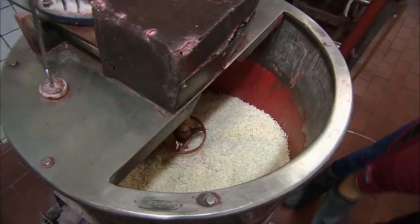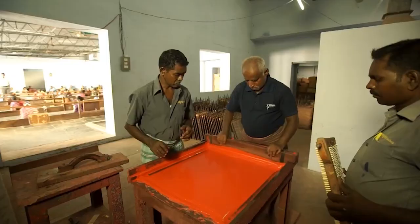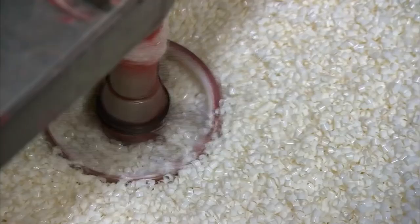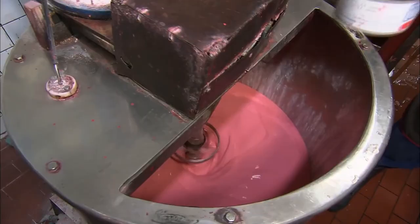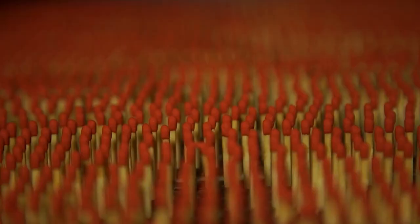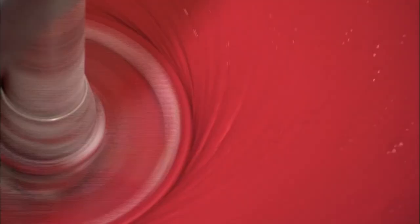Besides these two, workers add water to the sides of the mixer, both to rinse them and to keep the thick mixture liquid enough to be used. Once the gelatin has dissolved all the potassium chlorate, the worker adds additional additives like silica granules, which control the combustion by slowing it down, some coloring agents, which help distinguish between burnt and unburnt matchsticks, as well as other chemicals to help with clean burning. After about 40 minutes of continuous mixing, the mixture is finally ready for the splints.